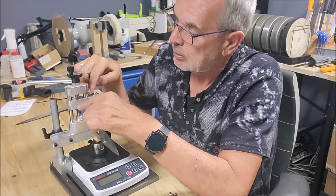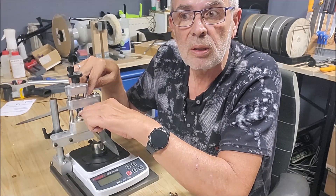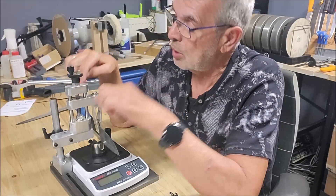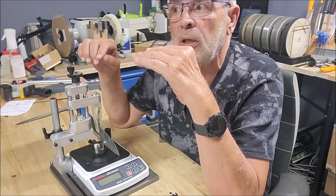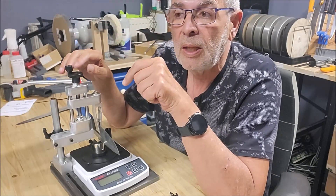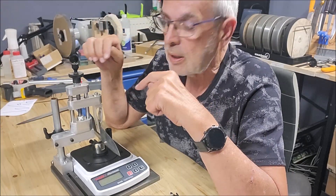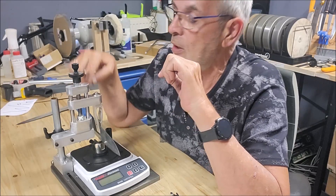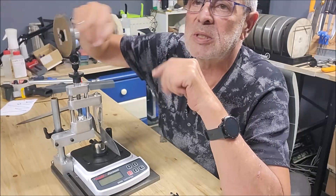What I want to say is: this spindle here is from my new grinding machine and it's a 12-millimeter metric thread. This is not fine enough — the final version will have an 8-millimeter fine thread. With the current one, one full turn moves almost 2 millimeters, which is way too much. The 8-millimeter fine thread moves only 0.75 millimeters per turn, so you can turn a little faster or slower and it makes no difference in the measurement.